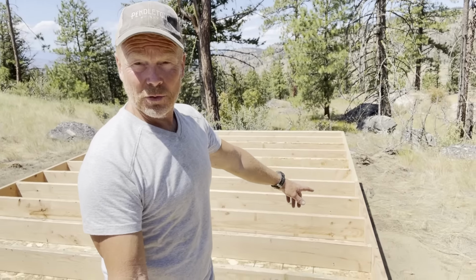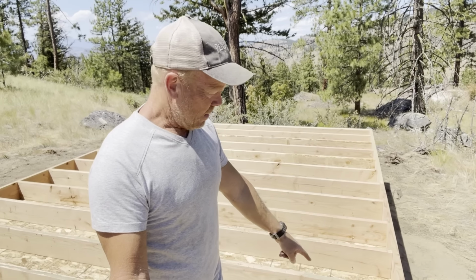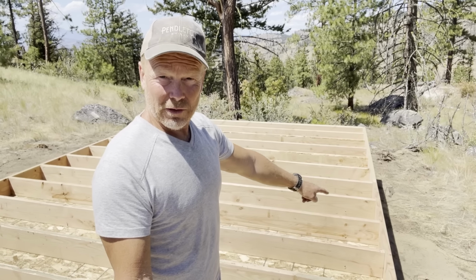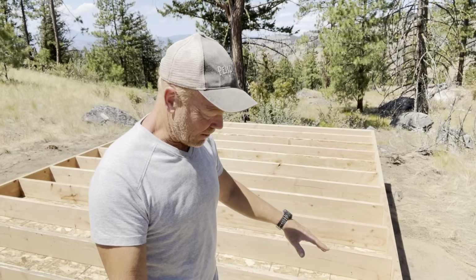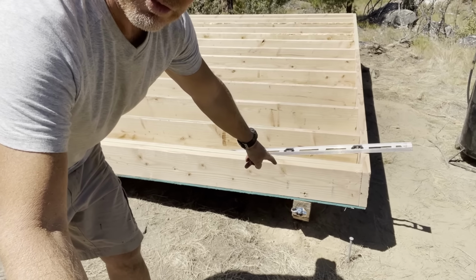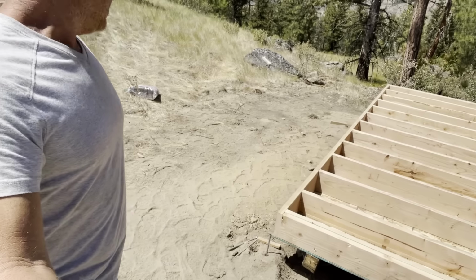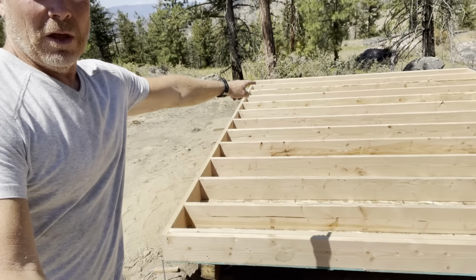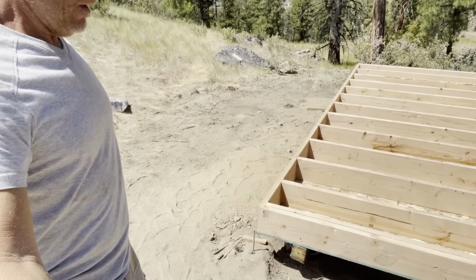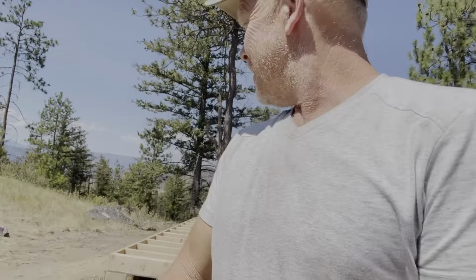What I did while this was charging is I had some lunch, and then I took this beam under here and I put two 4-inch screws on every joist down into the beam, very solid. And now what I'm going to do, I'm going to take a 5.5-inch screw and run it through the ends of the double. And I still have to put my 4-inch screws along the beam that runs right under there. All right, we're cooking. More ways than one are we cooking.